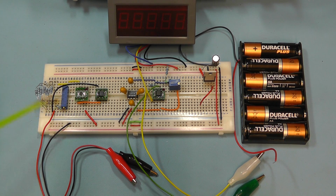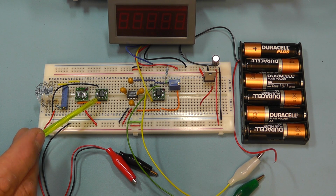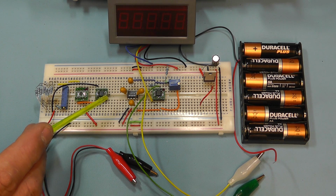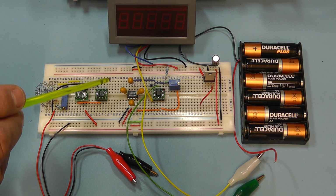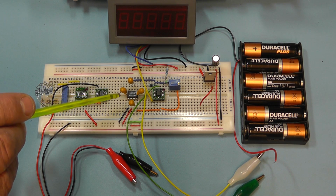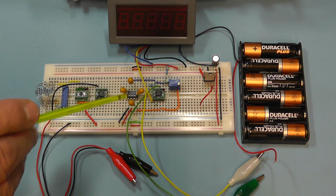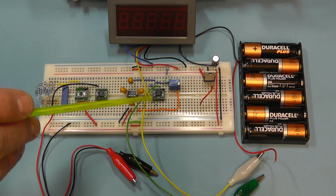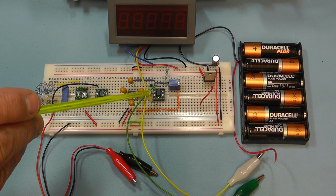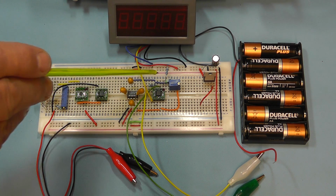Next to the constant current IC there's the shunt regulator. It's the 1.25 volt shunt regulator IC, the LT1634. Moving on, there you have the MAX680, which is the voltage converter IC with its 4 capacitors, and in this case I'm using 4 tantalum capacitors, 4.7 microfarads. Then moving on, there's the precision differential amplifier. That's the INA106 together with its associated resistors there.